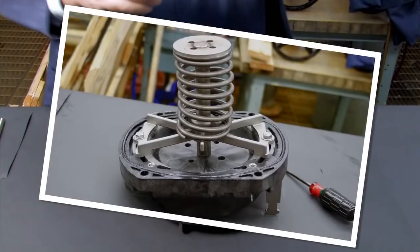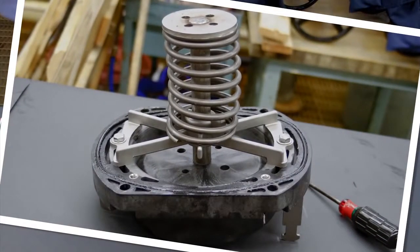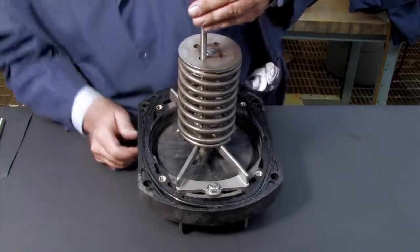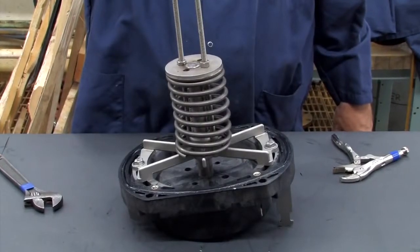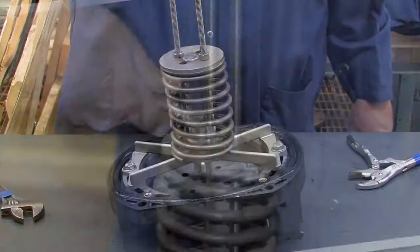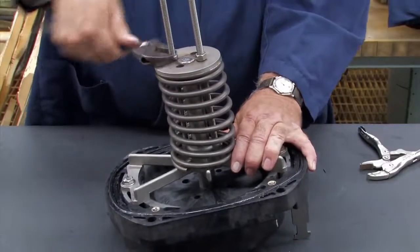To access the seat and clapper rubber ring of the number 1 check, place the check on a flat surface with the coil spring facing up. The spring surrounding the clapper shaft must be compressed. Place all-thread rods through the two holes in the spring retaining plate, then thread the rods into the hole at the base of the spider, tightening with two nuts threaded onto the rod. To compress the spring, loosen the top nut and back it off without unthreading the rod from the spider. Using a crescent wrench, tighten the nut closest to the spring retaining plate, ensuring both nuts are tightened evenly for a safe, level compression.